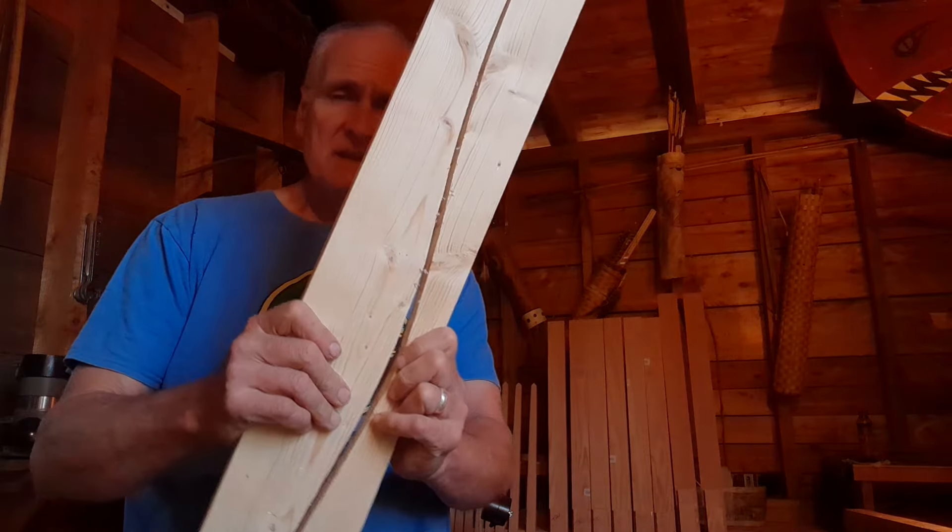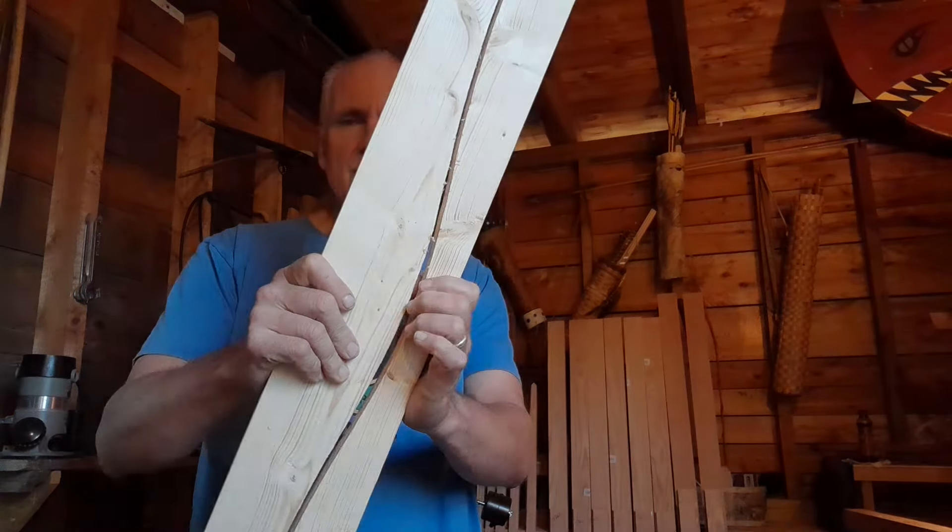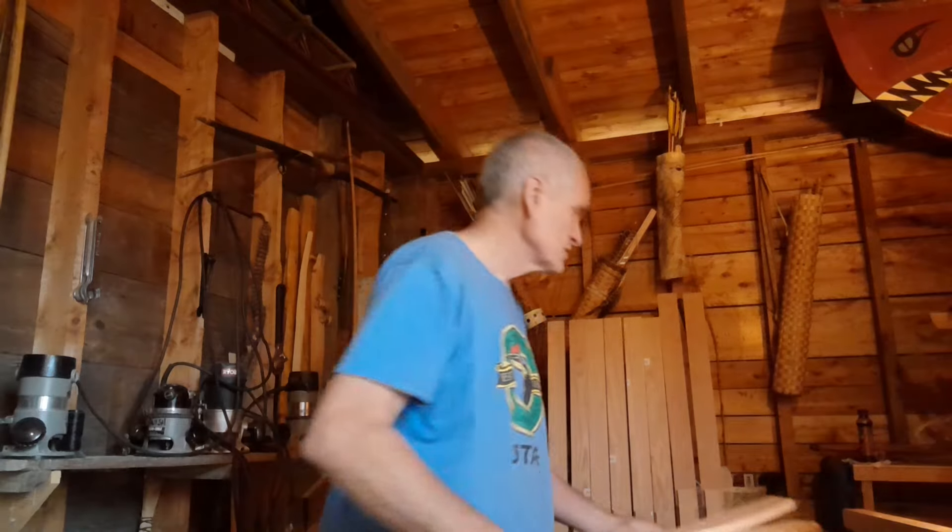This is a pattern — not a bending form — this is a pattern for a dull wing bow. You can see there's more gap here in the center; it's varying thickness. Coming up with a press with thicker wood, multiple of these, so I can do a run. Instead of my turkey boiler — you know, the thing where you put oil in, drop a turkey in and it explodes — I have a pot of water with aluminum foil over the top for steam bending. To do a single bow and correct a side bend takes about three hours, and that just can't happen — plus I'm burning up all that propane for a single bow.